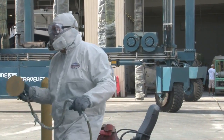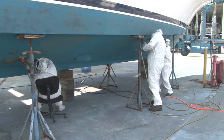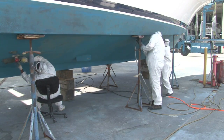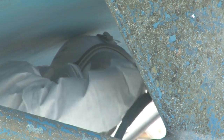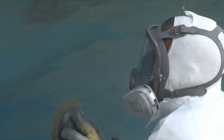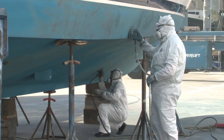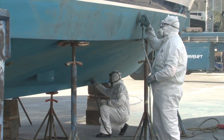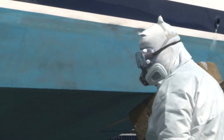Next, while wearing protective equipment, sand the entire surface to remove 80 to 90% of the old paint. Like all hard paints, do not apply EcoClad over old soft ablative paint since the soft paint will fail and the EcoClad will come off. Sanding dust from old anti-fouling paints and other products can be hazardous. Always wear appropriate personal protective equipment when sanding.